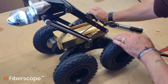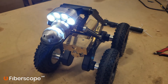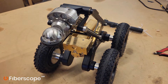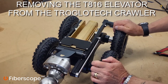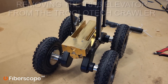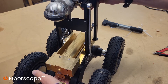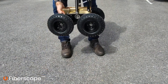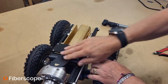That's a fully pressurized system. If you turn the wheels it generates electricity and the crawler will initialize — it'll turn back off again. That is ready for use. By the way, it's important to know how to lift this: lift the elevator completely up, then have one hand under here, one hand here, and lift it like that. That's the safest way — don't try to lift it with the elevator down as it may spring up and you may get your fingers trapped.